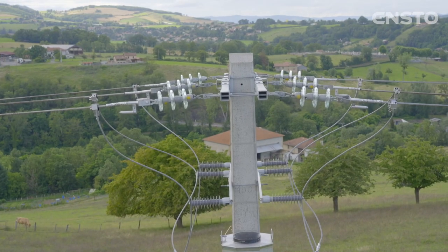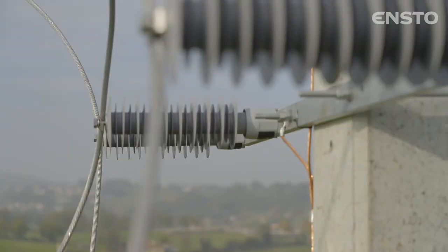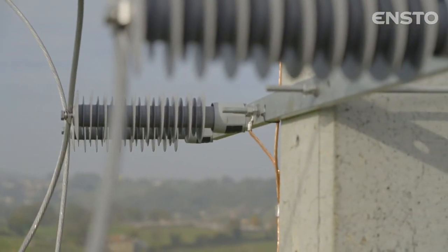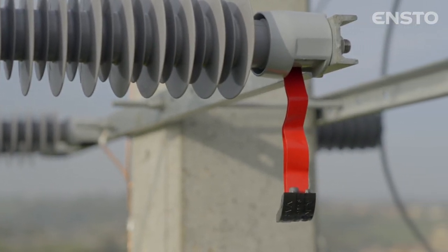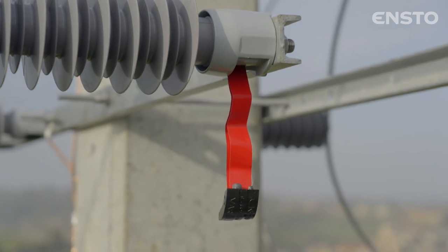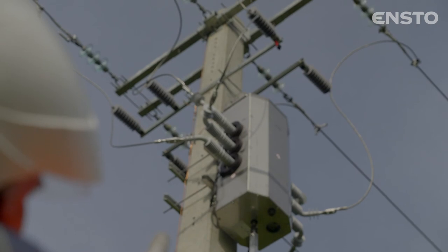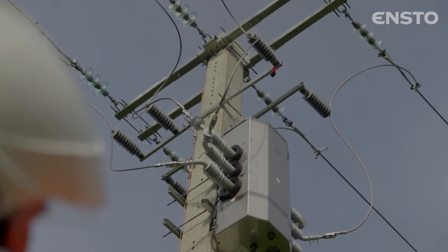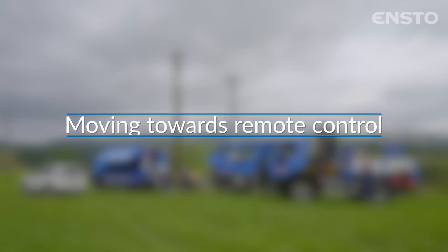In normal operation, the lightning arrestor returns to its initial state after smoothing power surges. However, there may be direct lightning strikes on the lines, which exceed its absorption capacities. In this case, the lightning arrestor will short circuit. The lightning arrestors are equipped with a fault indicator. This flag is visible from the ground, facilitating location and, therefore, replacement of the defective lightning arrestor.